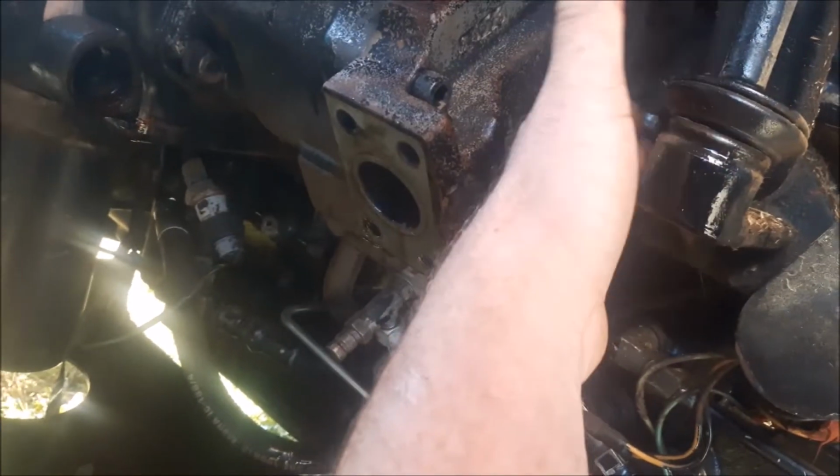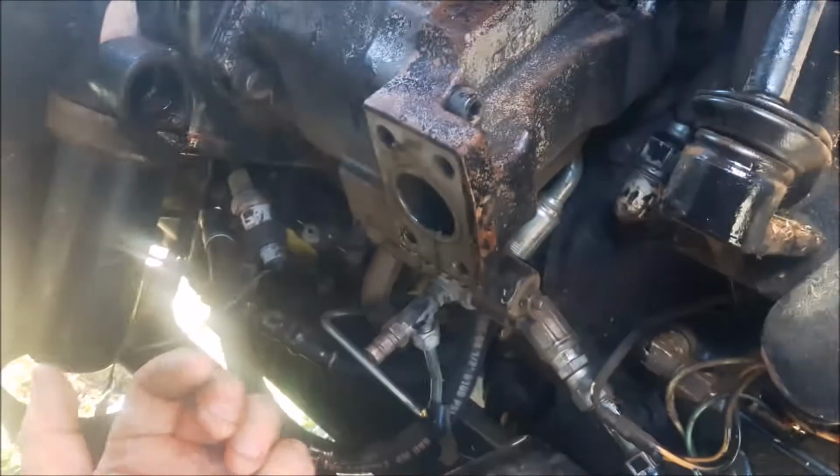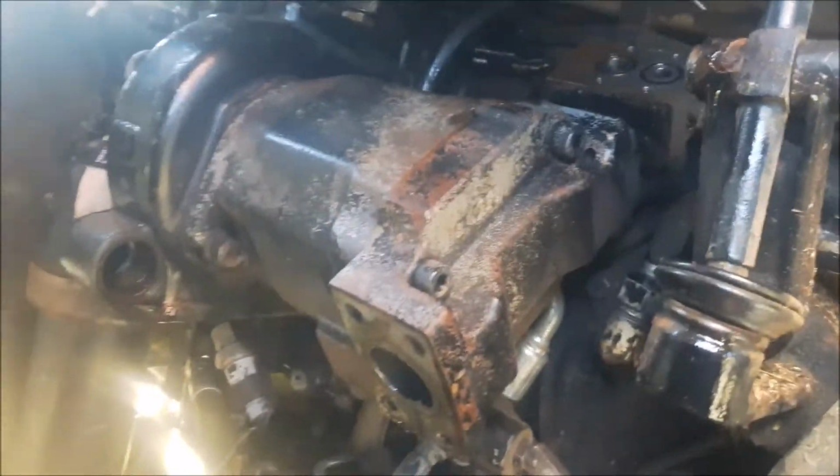That one's the drain off your relief valve up there, but I'll take this one off for your transmission, and that gives me enough room to slide it all out with that pulled up in gear. Then there's your speed sensor. I just loosen it and back it way off. That's for the RPMs on your engine.